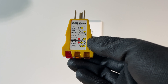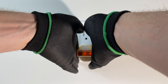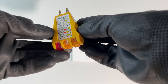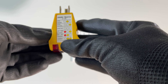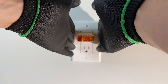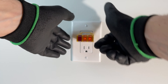I'll leave links to all these things that I'm using today in the description below. So you can just plug this in, and we're looking for two orange lights on the right side there — and we do see them. Two orange lights represents that this is correctly wired and functional. Now, most of the time your outlets are going to be the same on the top and the bottom. However, you might encounter a switched outlet one day, so it only takes a second — you might as well test on the top and the bottom. My two lights on the right side again, so we are good.